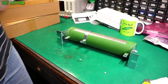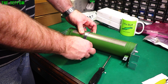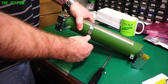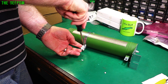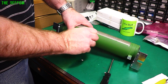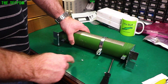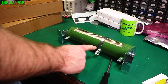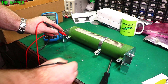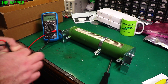It's a big resistor — a very big resistor. This is a 50 ohm, 5%, rated 1000 watt resistor. Not only that, it's a variable resistor. You can loosen off this screw here and it's got a slider which you can move to different positions on the range to get a different resistance. Apparently you attach a wire to this piece. It will slide along — there's a little post going into this part. So if you want 50 ohms you go end to end; if you want a different value you go to the middle. Let's get a meter out and do a quick test: 32 ohms here, 18 ohms here, and here to here should be 50 — and it is. Good enough for me.